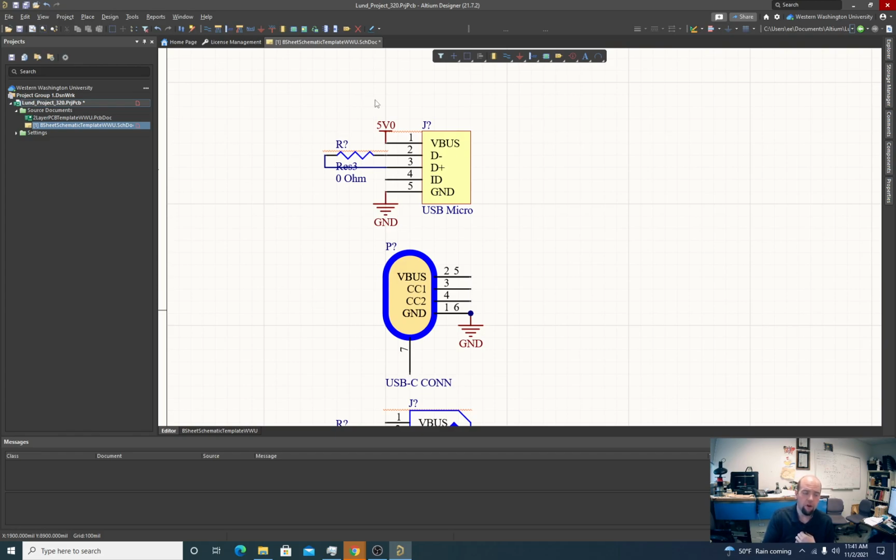This has actually become a problem for devices that are 1.8 volts. Any device that's powered under 3.3 volts has this issue where, if it wants to use USB, it has to bump up the power. But usually it's easy enough: if you're connected over USB, you're going to have that 5 volts from whatever you're connected to. So just have a separate section of the chip that's powered by the 5 volts and does the conversion to 3.3. But something to remember.